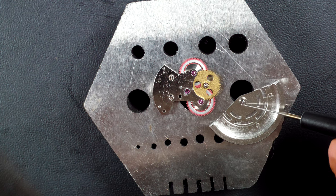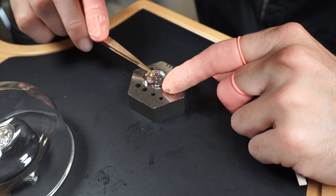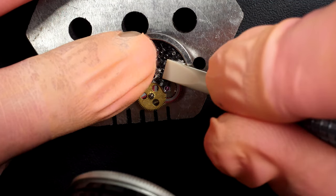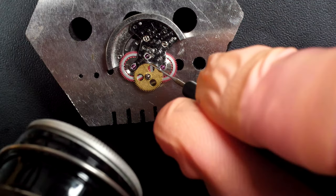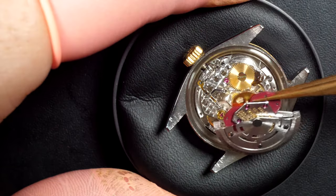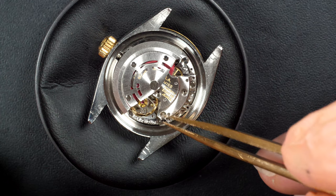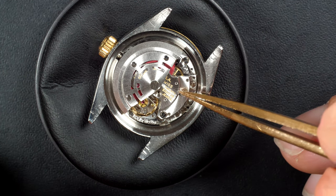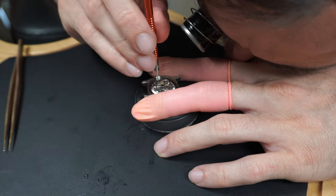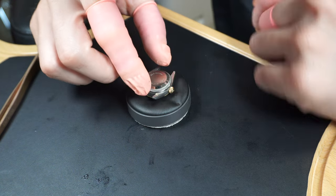Screwing the reversing wheel assembly in place, then putting the rotor on — which now doesn't matter which direction it turns. Securing it with the small clips, gently pushing them in. Oiling the jewel to ensure it runs smoothly, then placing the assembly on top of the movement and securing everything with the three screws. Checking — it's turning, perfect. Closing the case back.